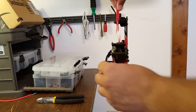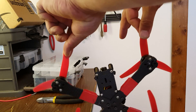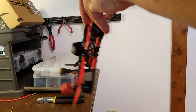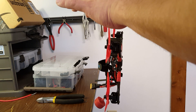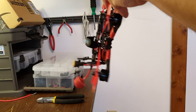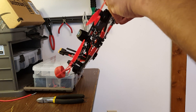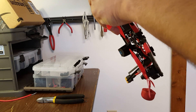What you're going to do is hang the copter by a prop tip — actually, I'm going to hang it by two prop tips. You're going to look and see whether the copter hangs level, or whether it hangs tipped one way or the other. If it hangs straight up and down, perpendicular with the ground, then the CG is more or less exactly on the prop line. It looks like my copter is tilted just a tiny bit, which means the CG is below the prop line. If it were tilted the other way, the CG would be above the prop line.